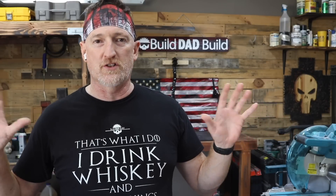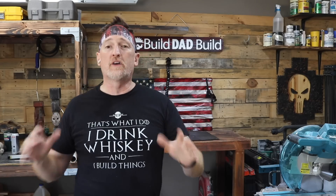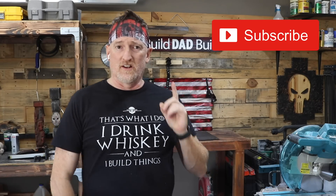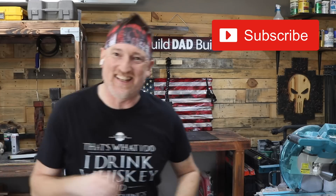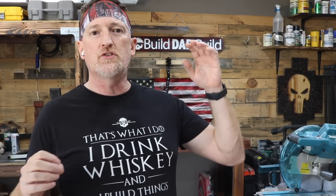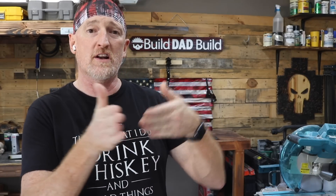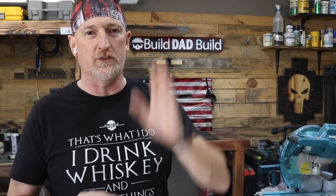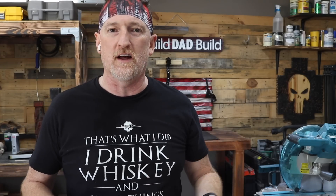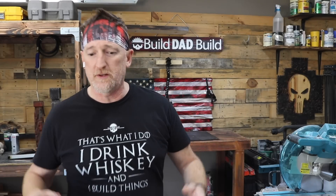It even comes with a big warning inside it. You can send it back in 30 days if you're scared of it, no questions asked. Okay, so now we want to prep our wood. I've done this technique on pine and that is it. Pine is not really a suggested wood — what I noticed is that since you have soft cellulose and hard cellulose material in pine, it tends to follow the soft cellulose material until it gets to a line of hard, so a lot of times it will reroute it. Sometimes you'll get really uniform vertical lines when you want more of an organic pattern. So what we're going to work with today is just a couple of things I picked up at the hardwood store.